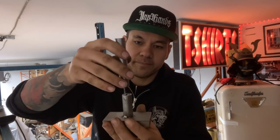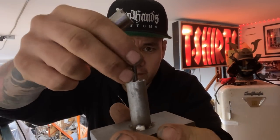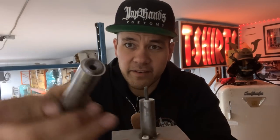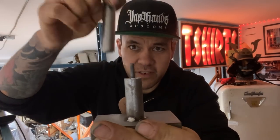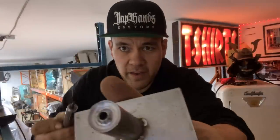I wish that, and I will do this in a future video, I had shown you guys first how warpy it was and how after I dimpled it all, it went back down flat. Hang tight, I'm just going to grab that dimple tool and show you guys. I did make this dimple tool in an earlier video that you can go look for if you like. Basically, it's just a little hammer tool that I've turned a male and female. You can just drill a 3/16 hole, stick the panel on there, and smack it with a hammer. It will make that recess for countersinking taper head screws, and that's what collects all that metal.